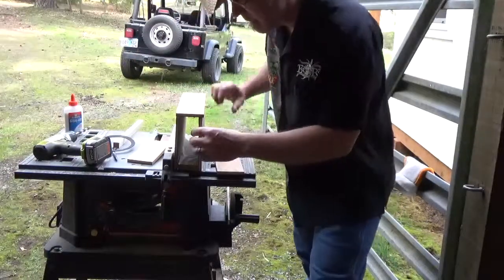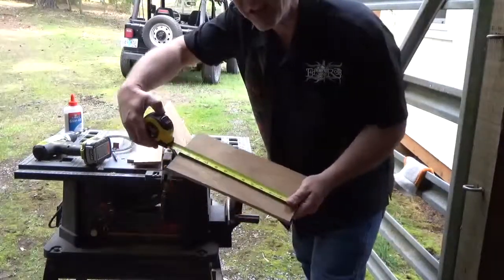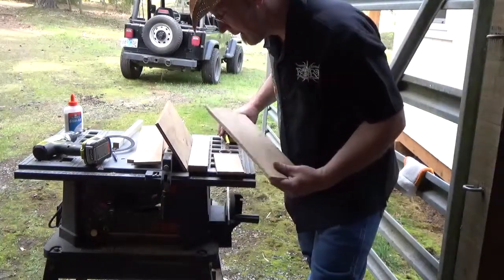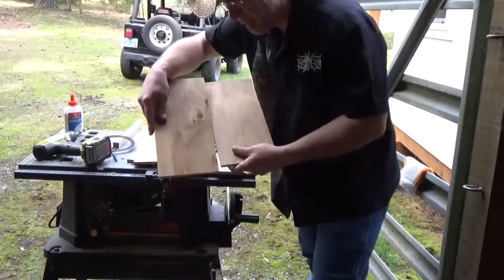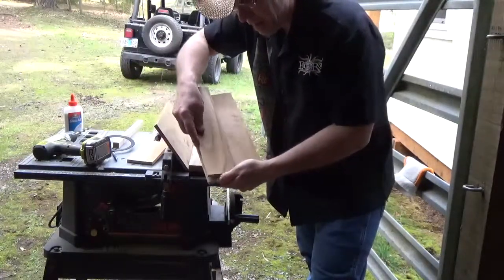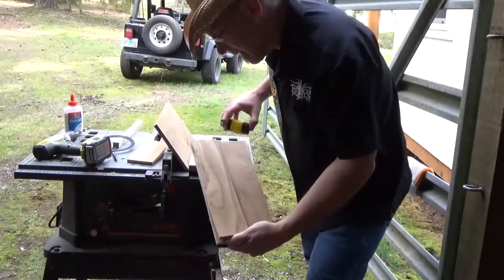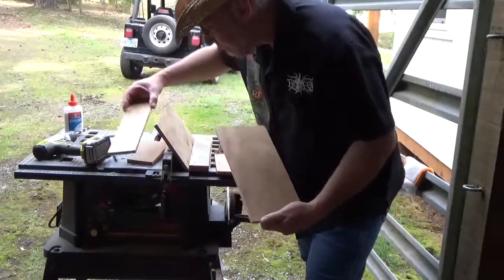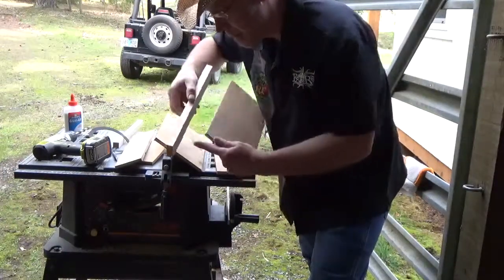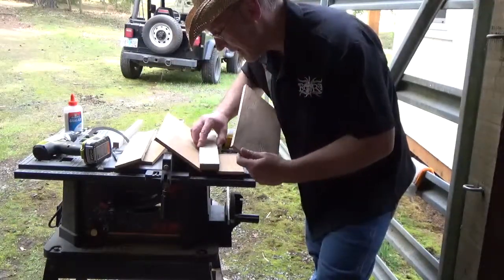Here's kind of a side view of what I came up with. These end pieces are 13 inches and I made them six and a quarter inches wide, so there are two exact same pieces for front and back. I also cut another couple pieces and ripped them in half at three inches. The bottom piece I cut a little bit smaller at three-quarter inch so I could screw it in — I want to be able to remove the bottom later.